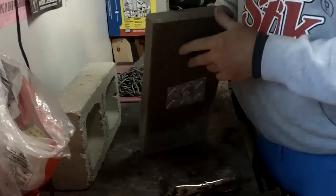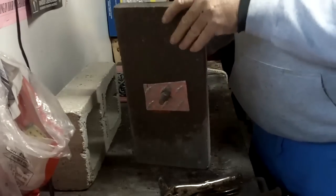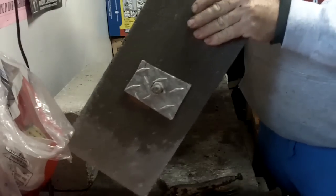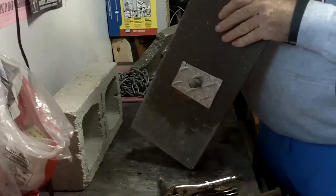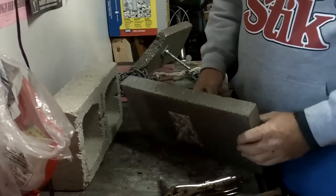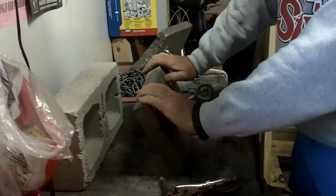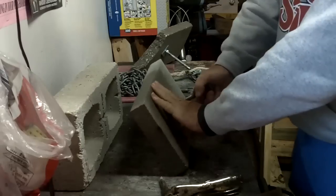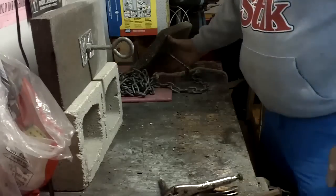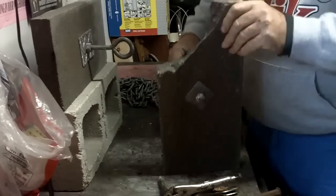So when I drop it over the side of the boat I don't just let it go. I hold it sideways with my chain in my hand and drop it over the side like that, and it goes down. Then as soon as it hits the bottom I want to stay tight on the chain and have it tumble down and get stuck — as we refer to it at the Mayport jetties — between a rock and a hard spot. That holds my 26-foot boat. Here is one that I just used and it didn't want to come out of the rock, so that piece broke off.